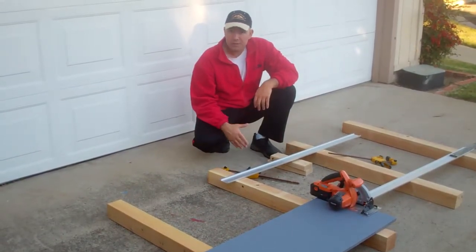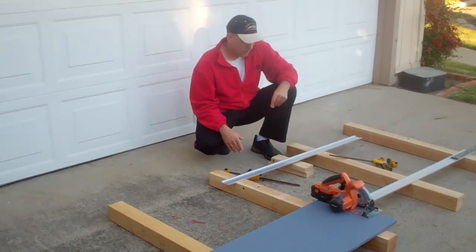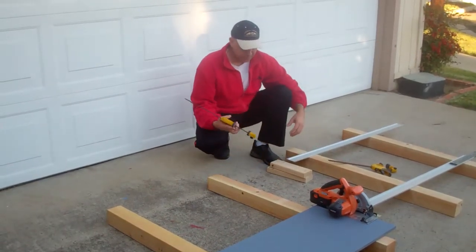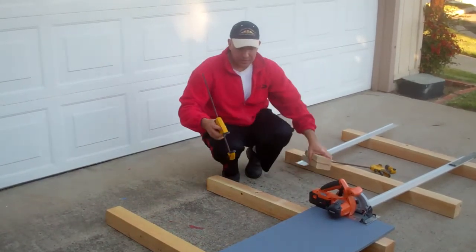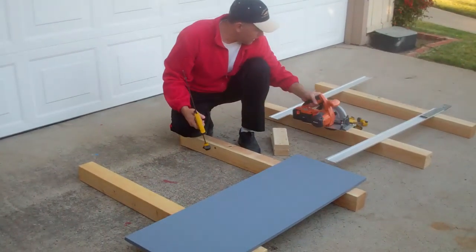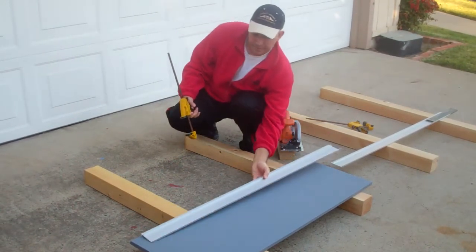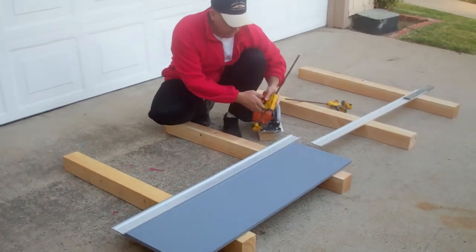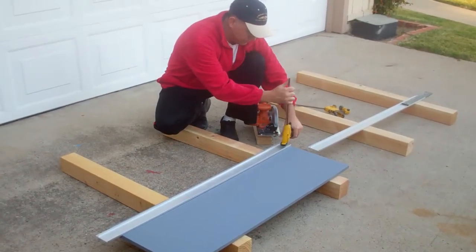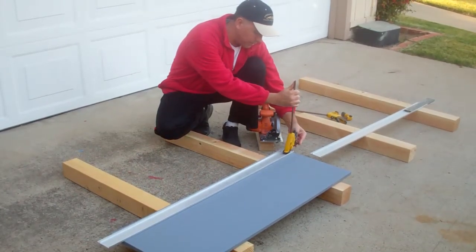A lot of home remodelers and general carpenters will set up this style, which is commonly called a floor style cutting platform. The 4-inch post provides a much better surface. As you can see here, I've got a piece of plywood sitting right here, and that gives me enough clearance for my clamp to then cut and clamp a cutting guide. Here's the cutting guide — you would put the clamp on each end and secure it into place for running your plywood cut.